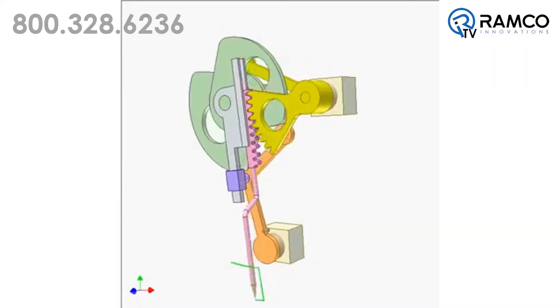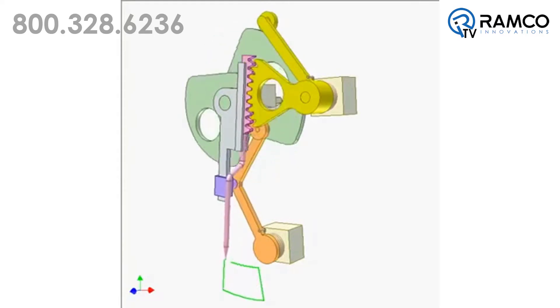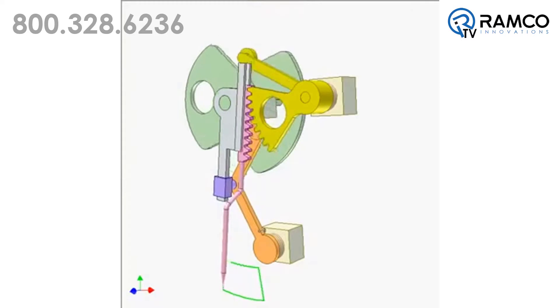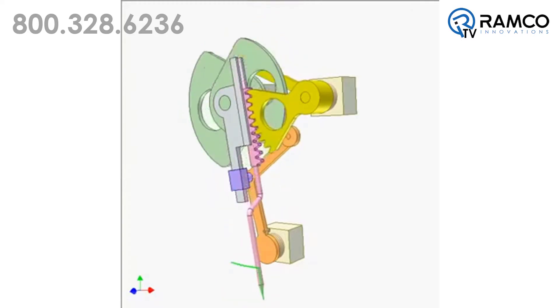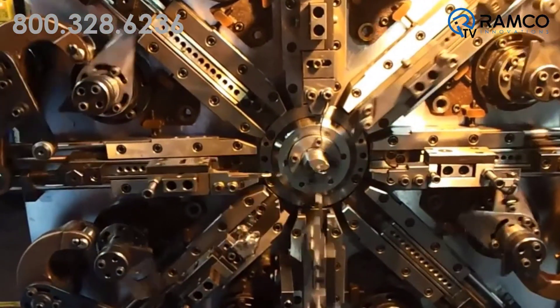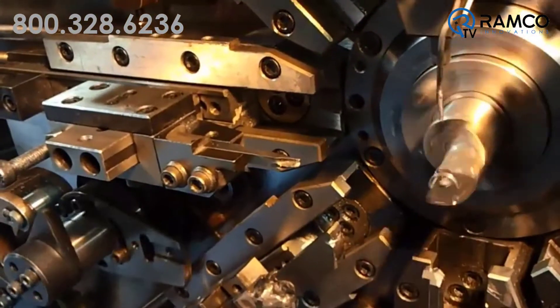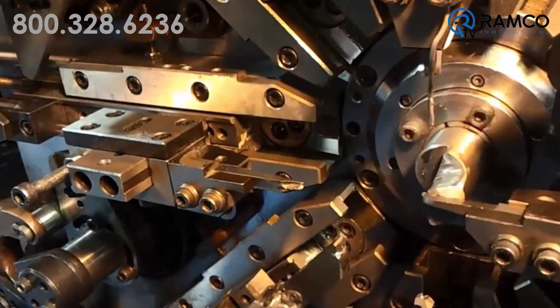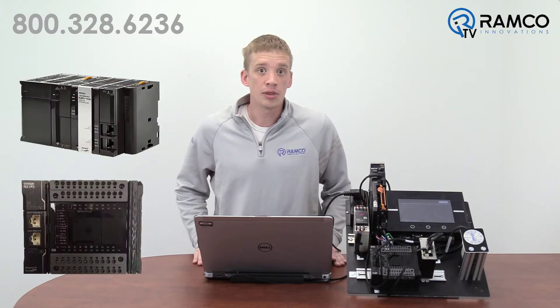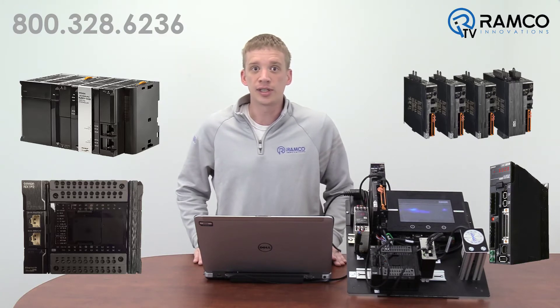The historic method of timing this process has always been to use mechanical cams — a long shaft with various cams. As the shaft rotates, the cams drive other mechanical arms or rods creating specific motions. This process can get complicated when it comes to timing and accuracy. Replacing these archaic methods with a servo and electronically synchronizing the process simplifies and can even eliminate those challenges. Pairing one of Omron Automation's machine controllers like the NJ or NX1P along with a servo like the 1S or G5 facilitates a simple and easy setup of electronic camming.